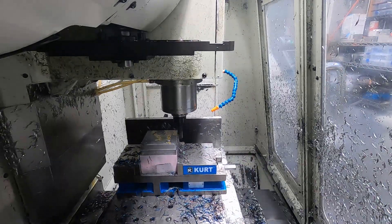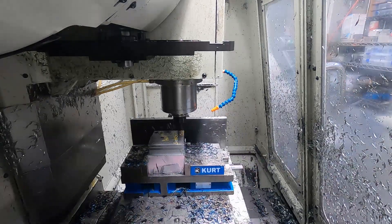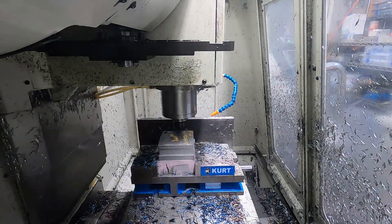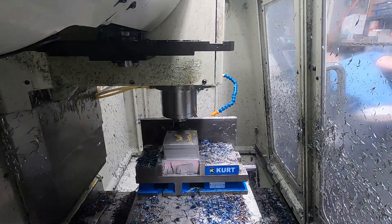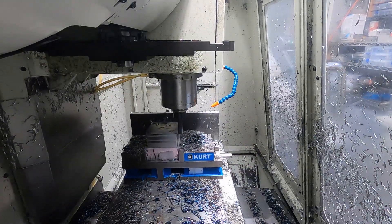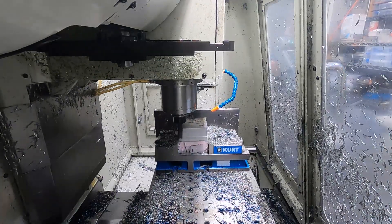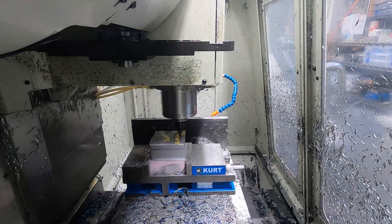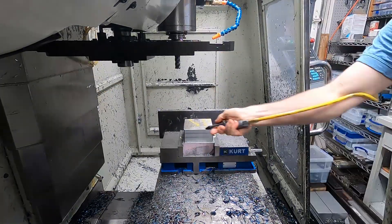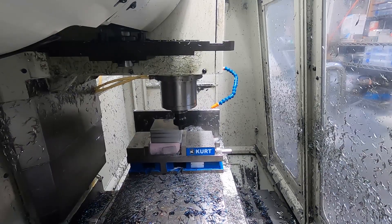So in this video, it's going to be a time-lapse of the machining and assembly of the adapter that's going to hold the KM-50 adapter. The material I used for this piece of tooling is 4140 heat treated material. It doesn't show it in this video, but I did grind the sides of the holder once I got done with the machining.